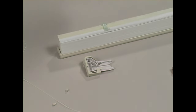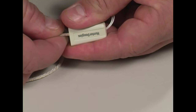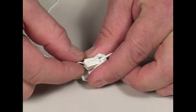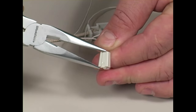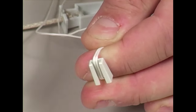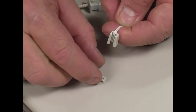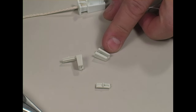I'm now going to take apart the stop ball. To remove the stop ball, I hold onto the stop ball itself and pull on the cord — that removes what we call the coffin out of the stop ball, which has some extra cord in there for leveling the shade. Then I pull my equalizer out of the stop ball housing. To take the equalizer apart, I use a pair of needle nose pliers: the wide end of the equalizer is the bottom, and I gently squeeze out the wedge. That wedge rams up against the cord to hold it in place. If it has no cracks, I'll reuse the equalizer — though there's also a replacement equalizer in the Hunter Douglas kit.